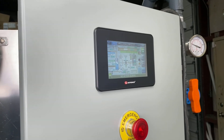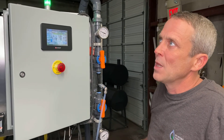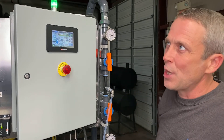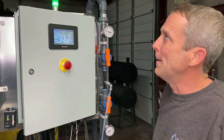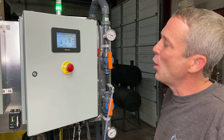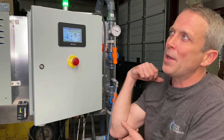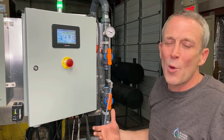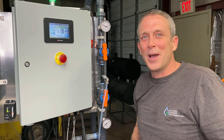This is our flow sensor for our level one system, but this flow sensor goes on all levels — it is the SA-6014 IFM flow sensor. You can look it up online, and we generally send manuals to all customers who want to dive deeper. For our system it measures water temperature and flow to control the system on and off. Generally you don't have to reprogram it once we set it up at the shop, but every once in a while someone hits the wrong button, so we made this video for anyone who may need it. Thank you very much.